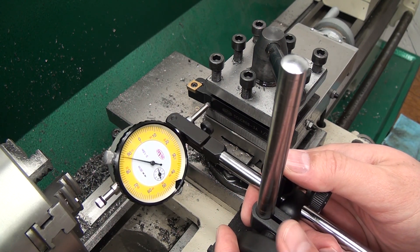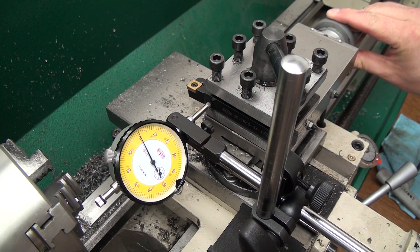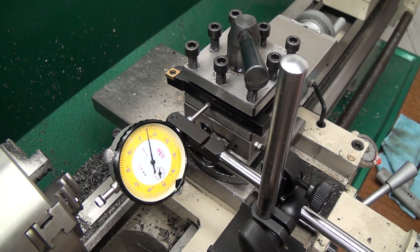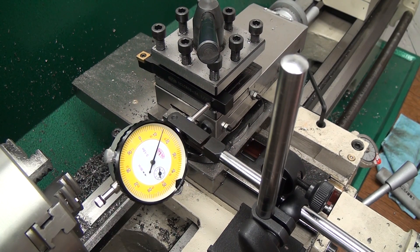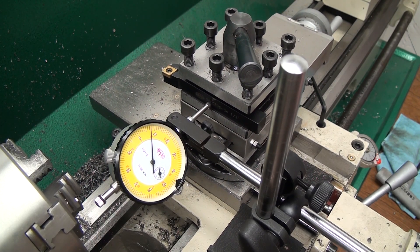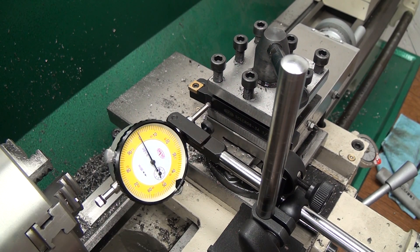I very carefully cleaned behind the tool before shooting this video, made sure to get all the grime and chips out of the crevices back there, and I'm confident that's not going to be part of this issue. But 12 thousandths also feels like a failure. I'd love to hear your comments as to whether or not this is considered accurate — I think it's not. The answer is probably to get an Aloris-style quick change tool post and ditch the four-way tool post. That's an upgrade I plan on doing in the future, but I might bump it up now. Post your comments below, don't forget to like and subscribe — I've got more lathe videos on the way.